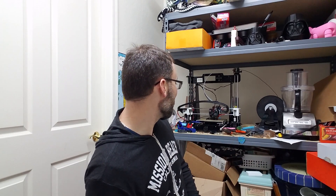It's not a permanent fix. It's definitely something that as soon as my all-metal heat breaks come in — which should be in tomorrow night — I will switch those out for the all-metal heat breaks. But it did get me going for now and got me to the point where I could print, and it's printing nicely and doing a good job.